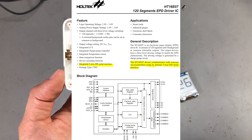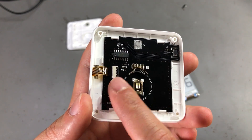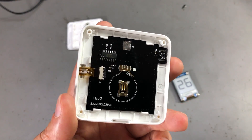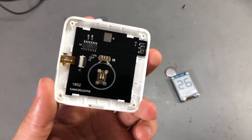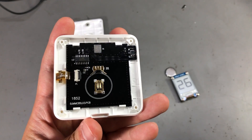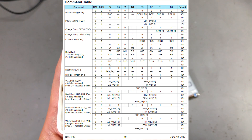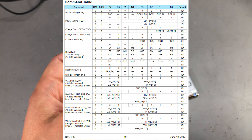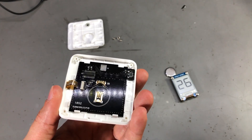If I wanted to reverse engineer this display and maybe use it for another purpose, I would start by probing the connections from the microcontroller to the display and figure out the pinout — this is most likely an SPI interface. Then using a logic analyzer, I would look at the commands sent by the microcontroller for various operations like display refresh or display update. I would then reference the recorded commands with those given in the datasheet of the HT16E07 controller chip, and if they match, I would be pretty certain that's our chip used on the ePaper display.